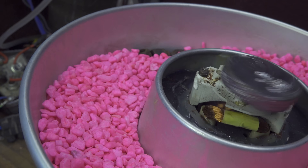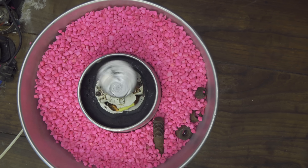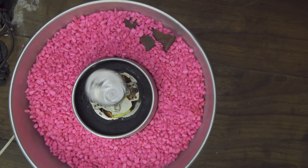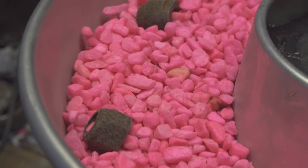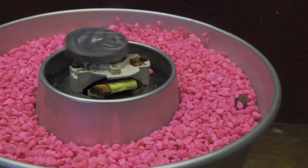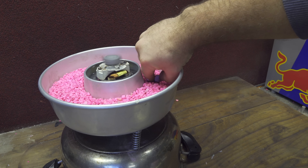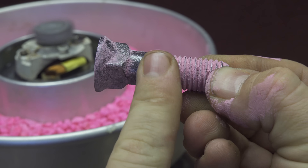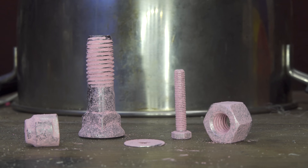I decided to keep the machine on for about 4 hours — a long time, but I want a very nice result. Consider that in this time we are also creating a very fine powder — this is quartz powder, and it will get inside the threads of the bolts and screws and clean all the rust away. This machine isn't only used for removing rust but also for polishing parts, for example wood to make it shiny and smooth, or plastic parts you can print with your 3D printer. After 4 hours this is the result: we have a very fine quartz powder on top. I remove it with a finger and the surface is nice and shiny.